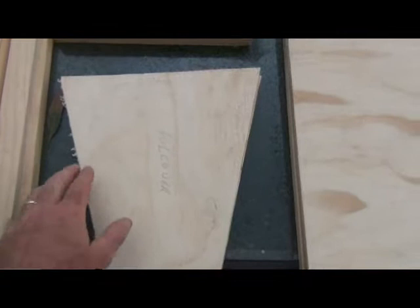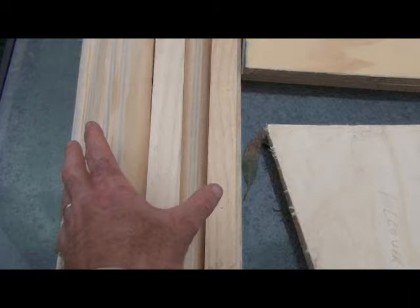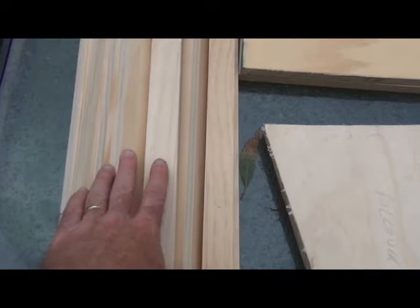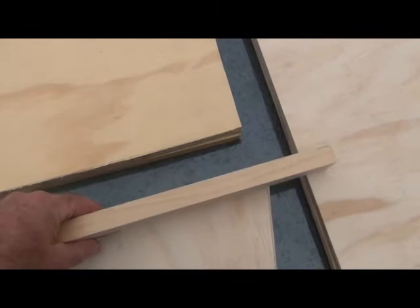The top bars are 34 millimeters wide — that's pretty important that you get the right one because it's based on the way bees make honeycomb. It can be plus or minus a millimeter. If you're getting wild bees that haven't grown up in a commercial beehive, you can possibly use 32mm bits of wood. These are basically the bars that the honeycomb are going to hang off. One of these bars will go on top of the follower board, which basically determines the size of the hive.